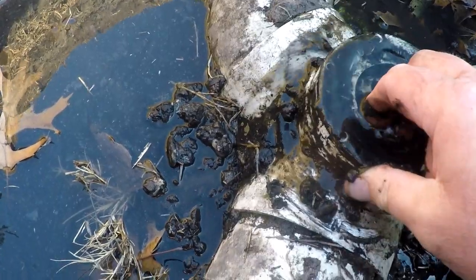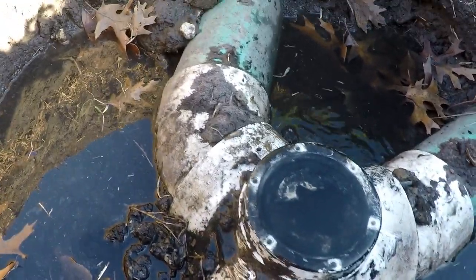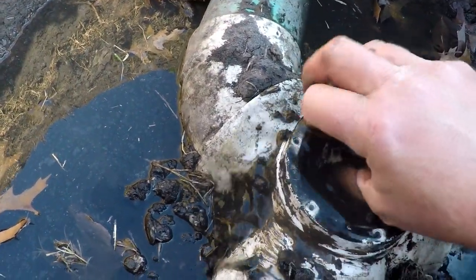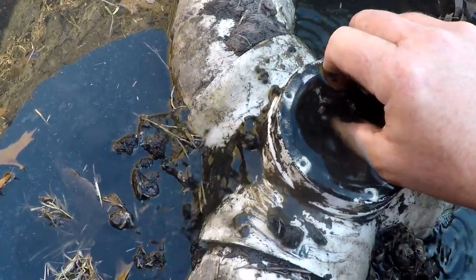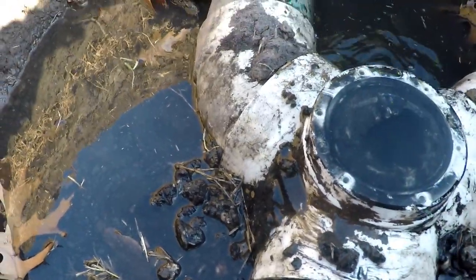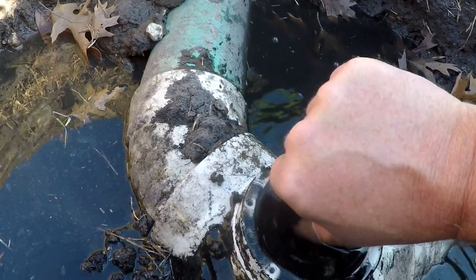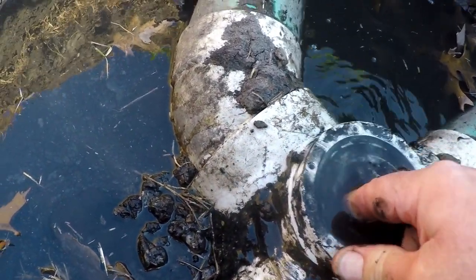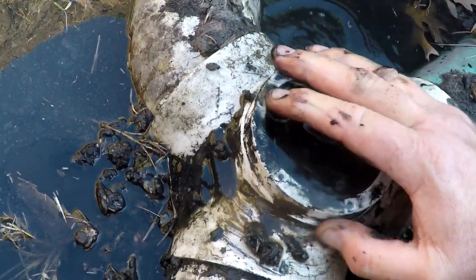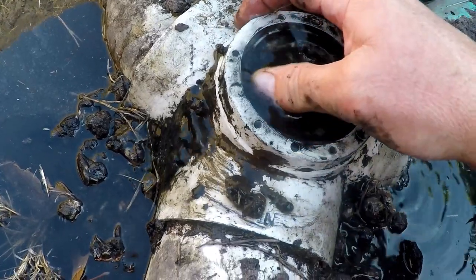The way these bull run valves are made, there's a cap, top cap, and then underneath that there's the actual switch itself, which fits kind of into a little keyhole on top of the valve. And then there's an O-ring in there as well. This is before I get the repair kit, so I don't really know how this goes together, and try not to break anything, so I'm trying to take it easy and just kind of feel my way around the valve.